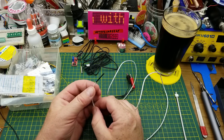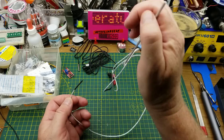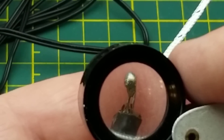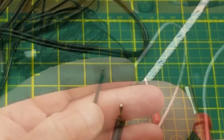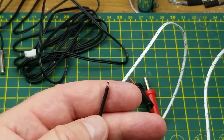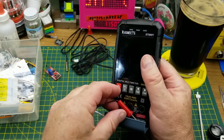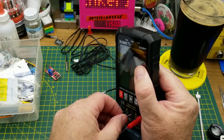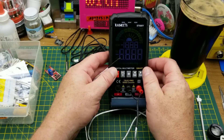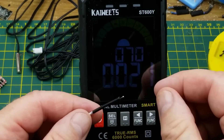These guys for instance - this is a thermocouple. It looks kind of similar to the thermistor at the tip, but what it really is is simply two wires with two dissimilar metals in that little blob on the end. Those dissimilar metals will generate a tiny little voltage when you apply heat to them. These things operate over a very wide range of temperatures and they often come with multimeters that have temperature sensing capability built into them. If we connect this guy and put it into temperature monitoring you'll see that just in free air it is measuring about 21 Celsius.